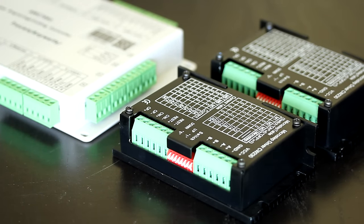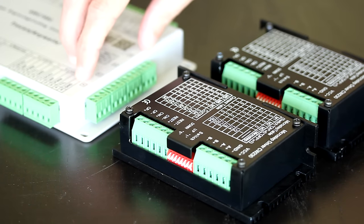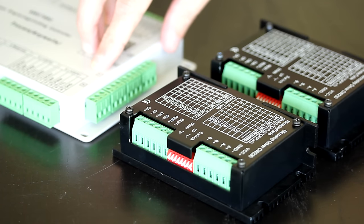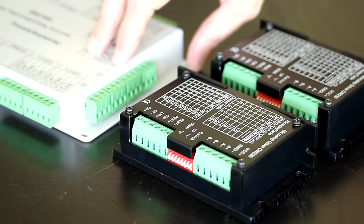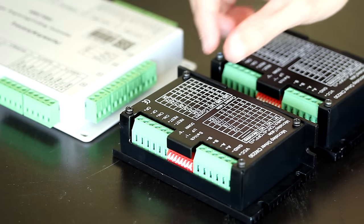I'll be connecting a total of two drivers — to the X-axis and the Y-axis. The X will allow motion in the X direction, and the Y will allow motion in the Y direction. We don't need a Z or U in this case. The Z is really for focus, and we're not going to have an automatic focusing system — we'll just be doing the focusing manually using a go/no-go gauge.